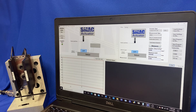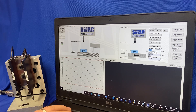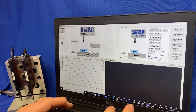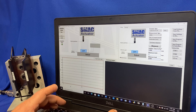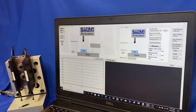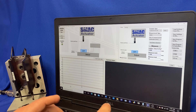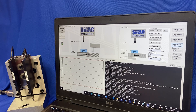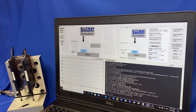We'll clear the screen again. We can put some information in here — we know roughly how far we want to go for rapid traverse, I'm going to say five millimeters for that. For limits, I'm going to use a one millimeter gauge block, so I'll set the high limit to 1.1 millimeters and the low limit to 0.950. That's adjusted our limits over here on the left. We can leave the tuning tab alone for now and go back to adjust later. We'll save the program into the controller — with filling in this data on the first screen you can get started doing your first measurements pretty quickly.